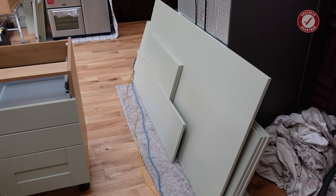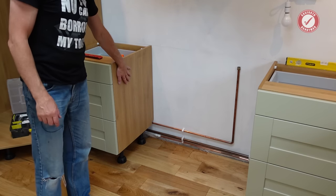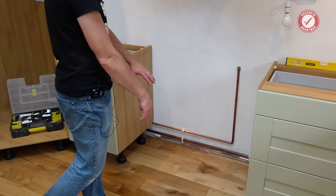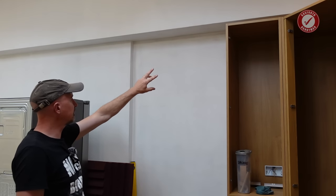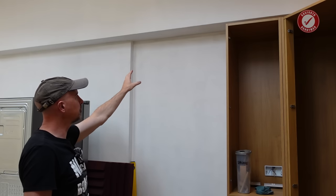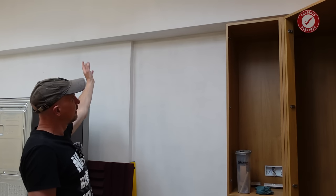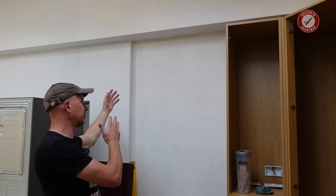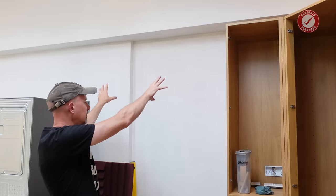We've got a whole load of end panels to fit. This needs an end panel all the way down to the floor, that'll need an end panel down to the floor, and that'll need an end panel down to the floor as well. And then that kind of frames in where the range is going to be going. I still need to fit the top box for the fridge, but obviously that needs an end panel on the far side to support it — otherwise it's just kind of hanging about. The end panel is probably going to need scribing to the wall, so I'll put some temporary support underneath it to hold it while I get the end panel in place.